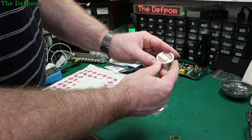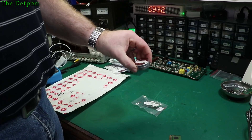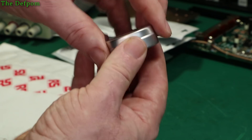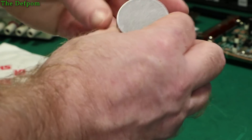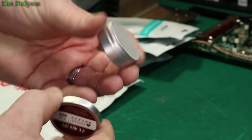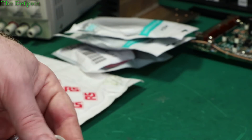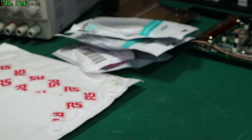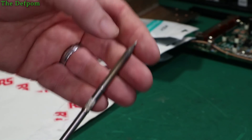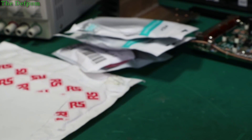This is solder tinning. I like to get soldering iron tip tinning stuff. It's lead-free — oh dear, lead-free tinning stuff, that's not what I wanted — but never mind. You just dip your iron in it and refresh your tip to keep it tinned. I thought I'd get some; I haven't had any before. I've seen other people using it so I thought I'd give it a go, because my tips do tend to end up a bit dirty. There's flux residue and corrosion on some of them. I'll get some and see if it's worth bothering with.